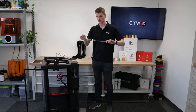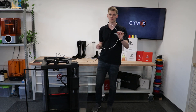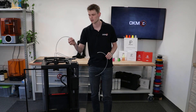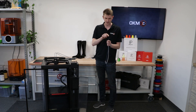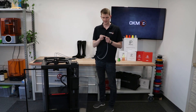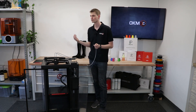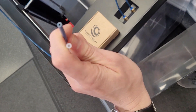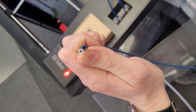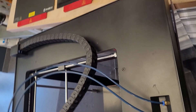We also exchanged the tubes leading the filament all the way to the hot end. The clear one is what was previously used in the Pro 2, and the dark blue one is what we've got now. They are from an American company called Capricorn. The Capricorn tube is far narrower than the other one and it is a PTFE tube, meaning it has very low friction for the filament to travel through. Due to the smaller diameter, the retraction properties of the filament are actually improved. Because polypropylene filament is pretty flexible compared to other more rigid filaments, this does provide an added benefit.